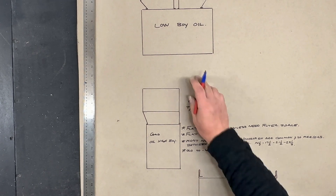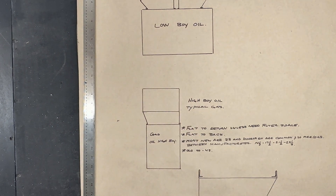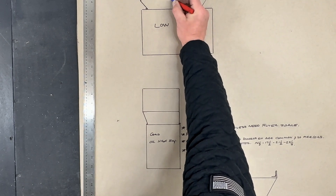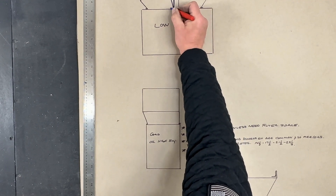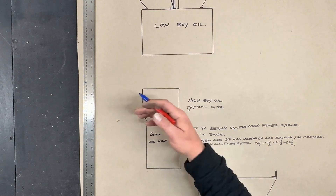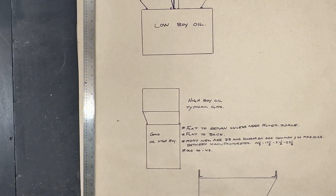When you're doing a low boy oil, most of the time you will have a two-inch space between the two transitions, but every once in a while you'll get one that's one inch. If you run across this, don't bother trying to make a transition to go there — just bring the whole thing down an inch bigger. You're not going to hurt yourself by having it at one inch and going over; it'll keep your spacing and you won't have to go crazy and make a three-sided transition on the job.